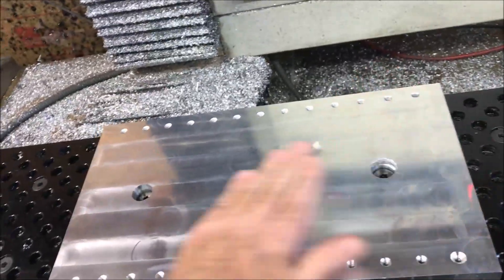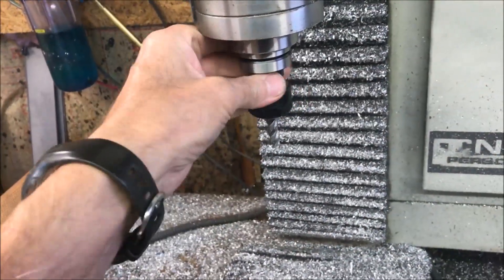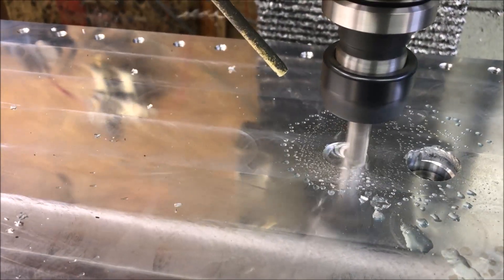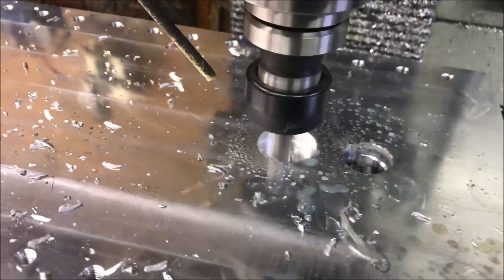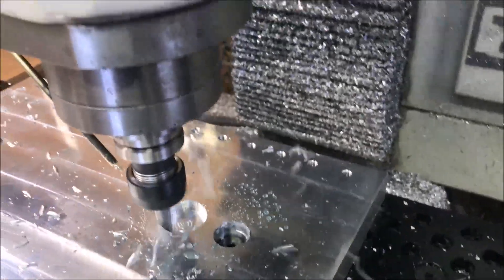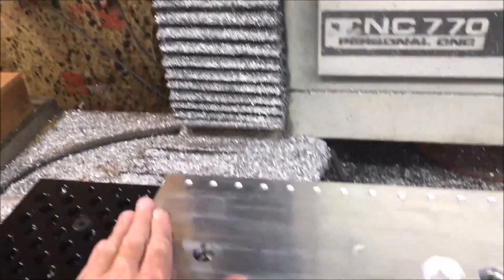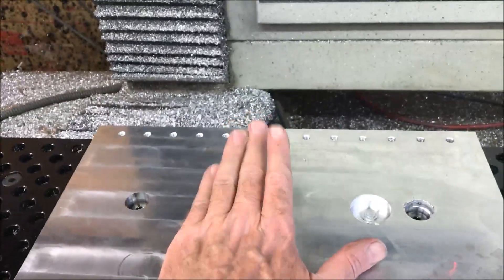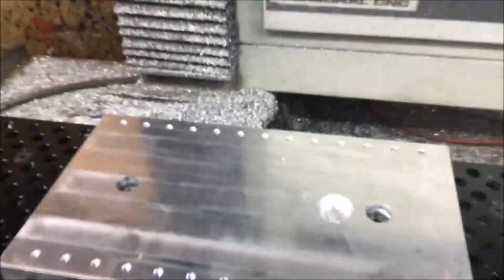All that's left to finish off this pallet is to mill out the big pocket in the middle. I was going to do that with a three-eighths, three-flute carbide end mill, but it certainly didn't seem to be liking that. So I decided to go with the shear hog and I'm also going to do a 2D adaptive clearing, two depths of cut. I'll probably stop and come back and film it as it goes along.